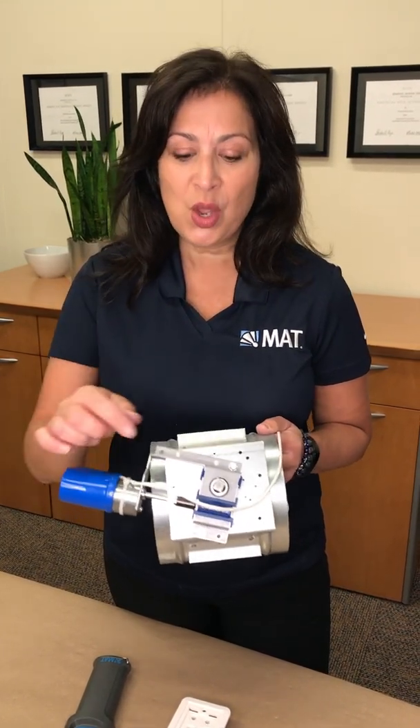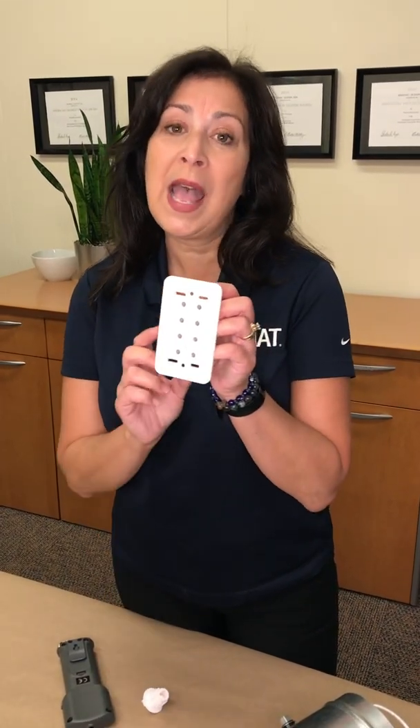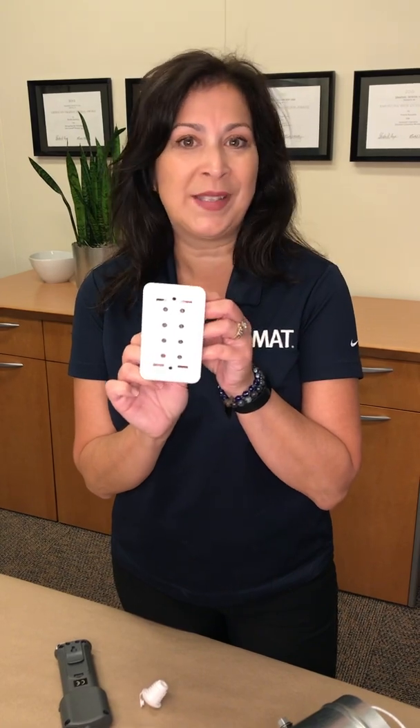The next damper series I'd like to speak to you about is our Electro Balance. We've taken our manual Worm Gear Actuator and added a motor that has been tested for 100,000 cycles. We replaced the cable with plenum-rated wire. The power is in the handheld remote control — it's a 9-volt battery. With this series, we offer two types of termination points: an individual port, and a port that houses up to eight dampers into one central location.